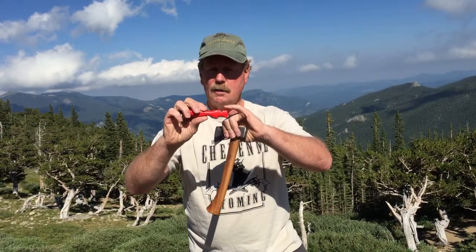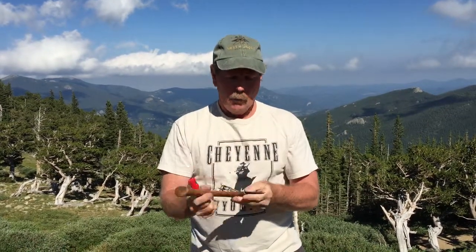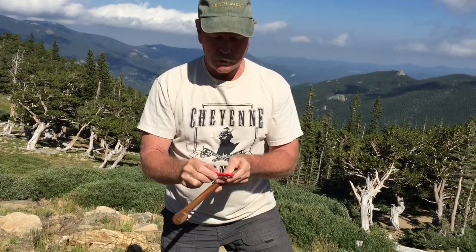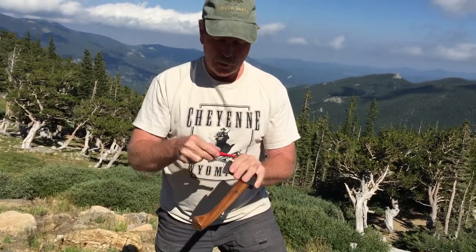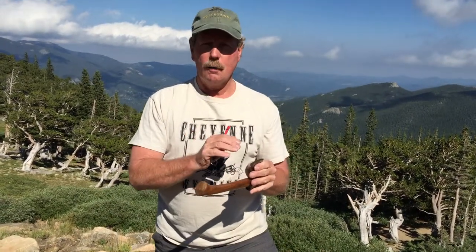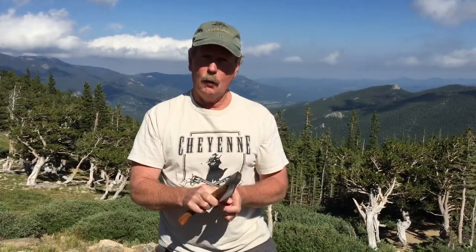I call this the open face. Down here we got two 90-degree corners — I've talked about this a lot of times. We take it like this and brush along the cutting edge, just like that. If you're gonna go out and chop wood, we don't care about the little wire edge that develops. But if you're gonna slice paper, you've got to get the wire edge off there.